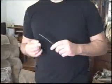Okay, now what I'm going to do is demonstrate on a fabric wall covering what was virtually impossible to do in the past. And with a putty application tool, you'll see that you can do it just as easily as you could on a wallpapered wall. We'll use the demonstration now to show you that what you could not do in the past was to fill any kind of a hole or imperfection on a fabric wall covering, such as combed cotton, satins, even silks. So we're using a combed cotton right now to show you.